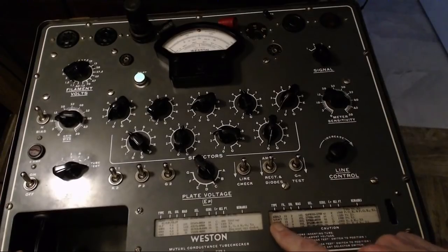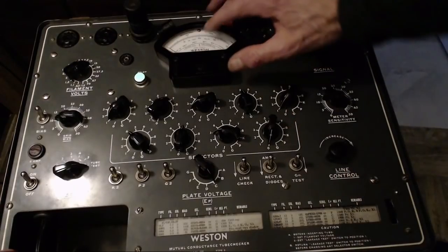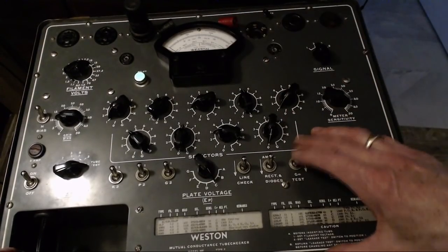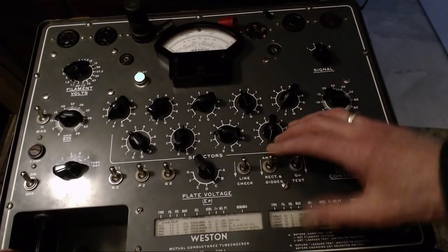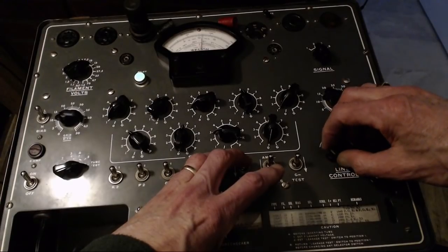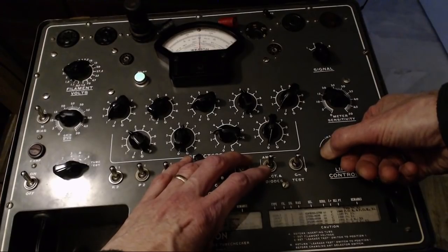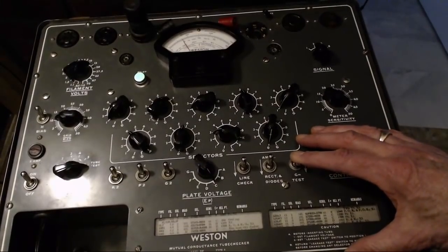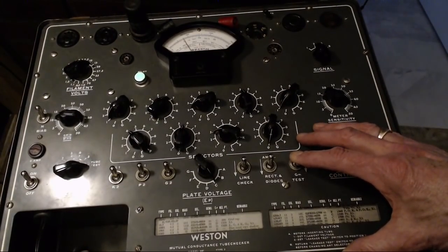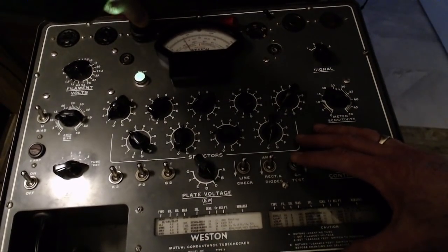Nope. So this guy, 12SK7. 1520, so it should come right up to the middle of the scale. It's weak too. How come everybody's weak? Let's just check the line voltage here, but I can't imagine it's not; it's actually set high. If anything, I've been helping the tubes out here. So that is supposed to reject at 1520. What's it doing? It's jumping around. Hold still.